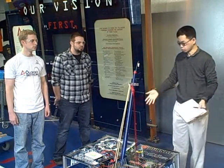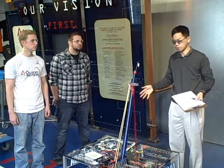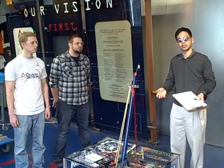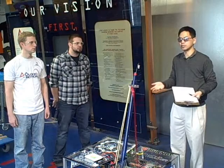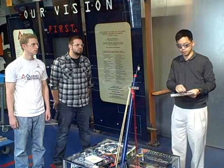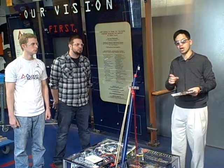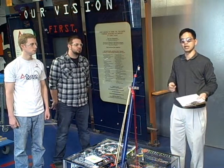We would start off with the weight of the robot. At an actual competition, there is a scale rated to the full weight of the robot, sized about three feet by three feet square. What I recommend for you as a team, if you want to check your weight, is maybe a couple of bathroom scales, one under each wheel of your robot. You add up the weight on the individual scales to check against the total. Remember, that's 120 pounds — no bumpers, no battery. Keep in mind those scales are probably not calibrated, so there may be some discrepancy between what you measure and what you see at competition, where the scale is calibrated.